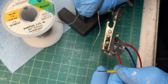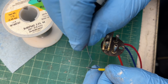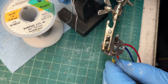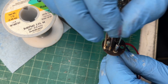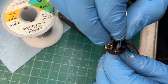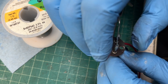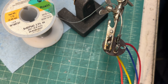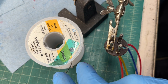I'm finishing up the lead dress for the field coil and the output transformer. I already have the length of wire correct with a little solder on it, and when I insert it in the pin it comes to the top. I'm going to put a little bit of solder down in the pin with the conductor, heat it up, and then go back and apply additional solder to the top. I've used this technique numerous times and it seems to work pretty well.